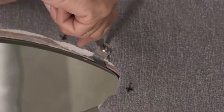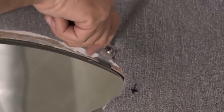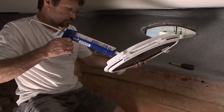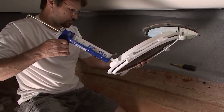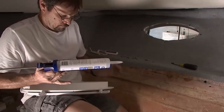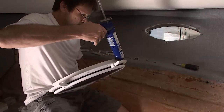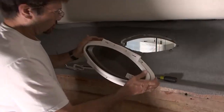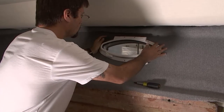And that's with a pan head screw. Talk about the housing for the inside portion of our port light — do we have to caulk that as well? Caulking is the most critical part of the install, and we need to be pretty generous with it. Either clear or white, whatever your choice is, but you want to use a marine grade silicone — not a 5200 or anything like that.